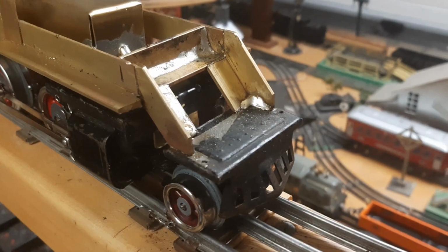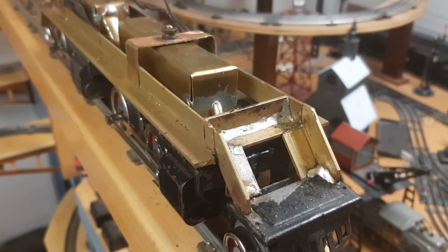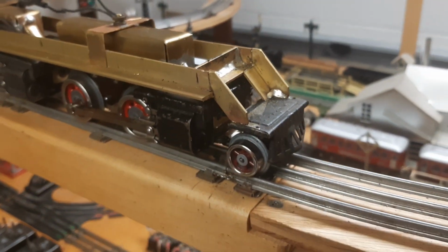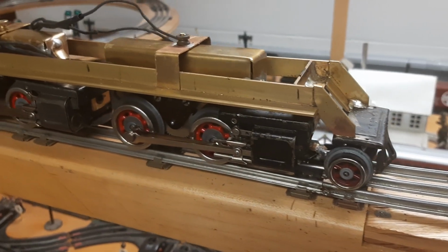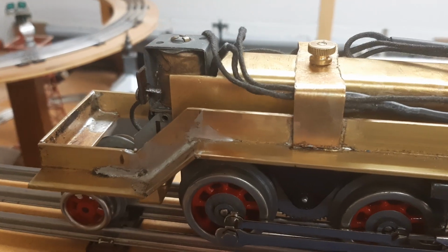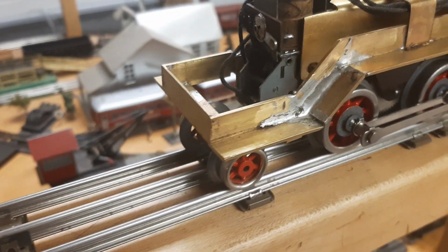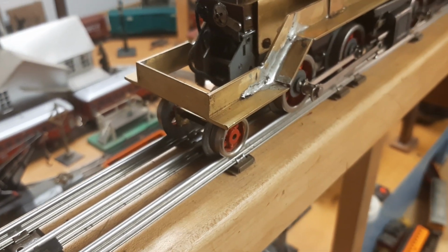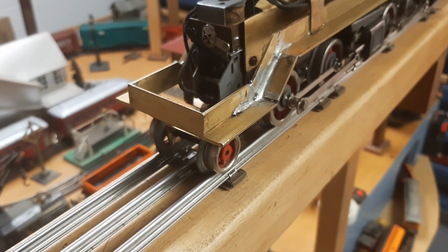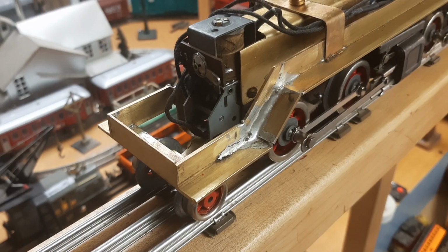And then this is brass railing that I bought. Little L beams of brass. But I laid out a drawing on a flat steel table, cut it all, ground it all down, soldered all of the rails together, measured how wide my 712 passenger cars are, and made the locomotive to fit that width.